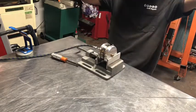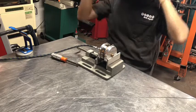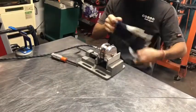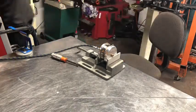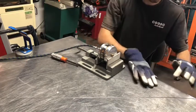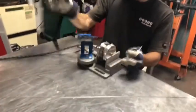I'm using 42 amps, a 16 cup, and about 30 CFH gas. It's already tacked up so we're just gonna start welding. Let me flush the gas out real quick — I spiked the purge to about 15 CFH for about 10 seconds just to flush any remaining oxygen out, and then we're gonna start welding.